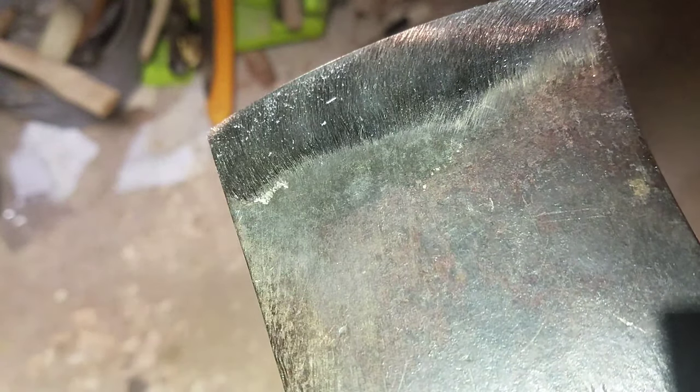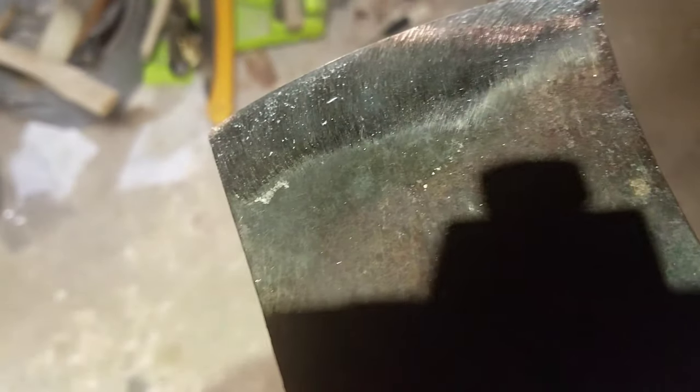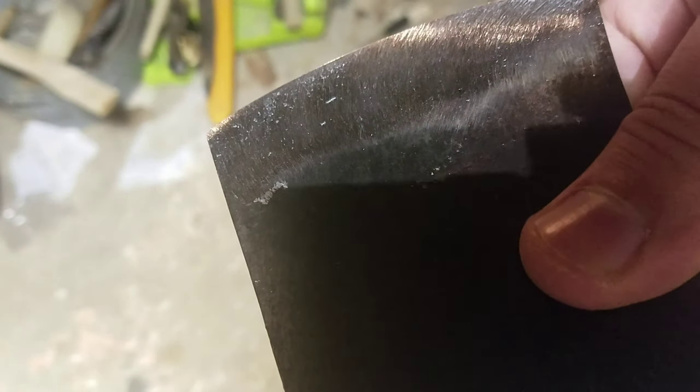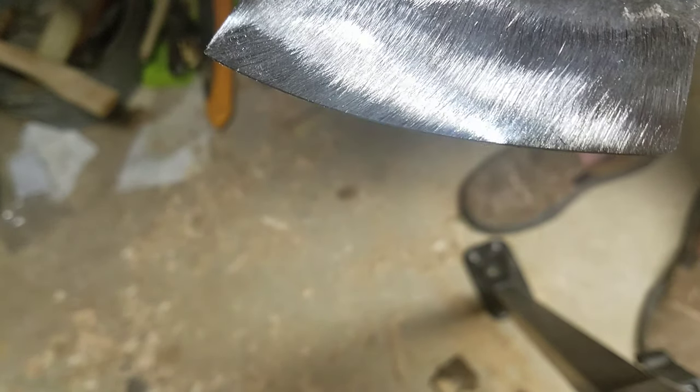You might be able to get a good look — yeah, you can see it. You see a little reflection at the very edge? That is the bevel. When it's really small and you can barely see it, they call it the micro bevel. I guess this would be in between because I can see the whole thing. You can finish it with a strop. You can see it all the way through. That barely took any time — I did not focus too hard on this. If I can do this, you can do this.